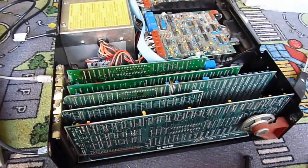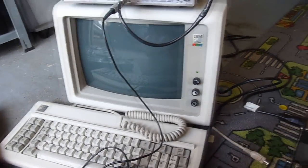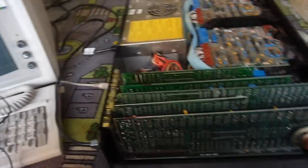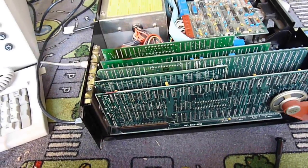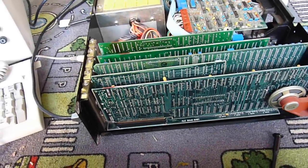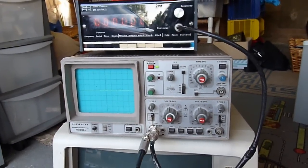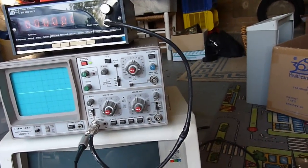We don't even have any video signal being pumped out to the CGA monitor — yes it's CGA, I made a mistake calling it EGA, that's the next standard up from CGA. There is something very seriously wrong with this motherboard. We've checked the RAM, tried it with different RAM chips, that doesn't work. We've got data flowing around on the motherboard — we can pick up various clock signals and data lines from various chips being pumped around.